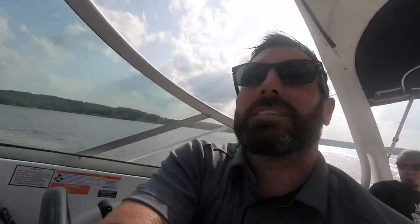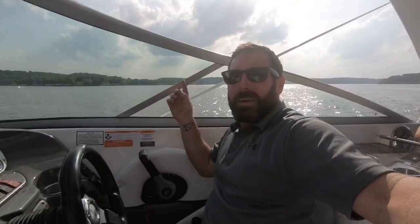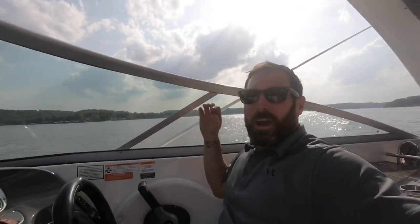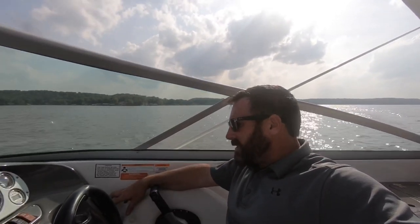Now let's say because of a bunch of people sitting on one side of the boat, you had your tabs set just right and they all move right over here because some great big chick just did a big cannonball over here, made a big wave. Well, then the boat's gonna go really crooked. That's okay, just stay calm. About 10 seconds, 1, 2, 3, 4, 5, 6, 7, 8, 9, 10. That takes them from all the way down to all the way up.